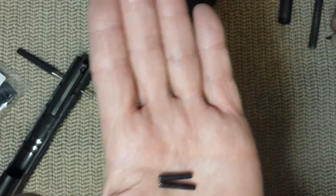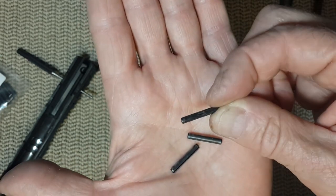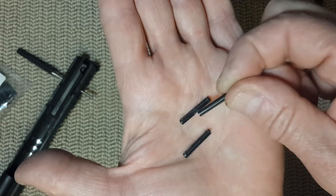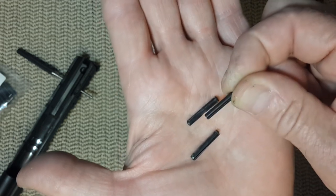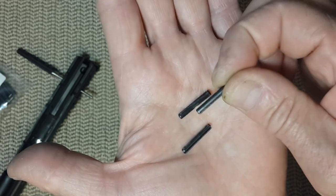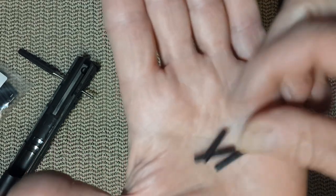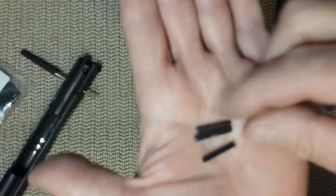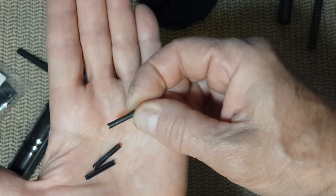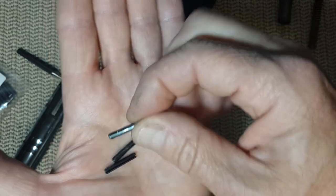Once you fire about 500 rounds after getting your new handgun, I suggest you pull your CZ75 pin out to see if it is damaged. And of course, if you want something made for it, you go to Cajun Gun Works and buy a pin. As I say, about $5 a pop, you can get two or three, because those roll pins are consumable. Or you can go the other way as well, the shorter one, or buy a bag of 100 and never have to buy any more of those. And that bag of 100 is about $12.